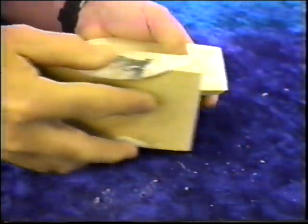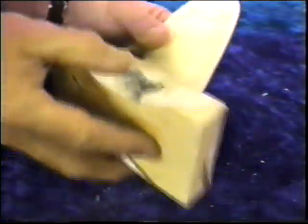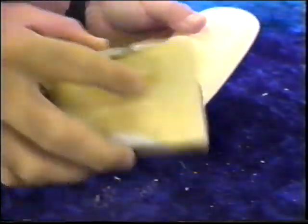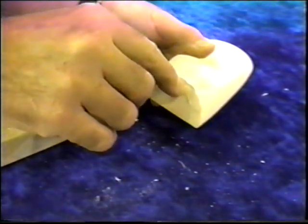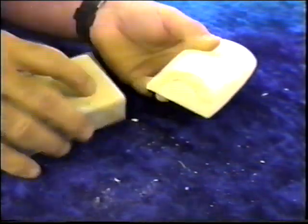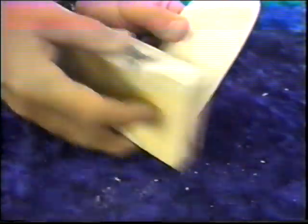This way you get at least a half a fighting chance of keeping those little edges. Edges of flaps, edges of elevators, edges of cowls. And this one is especially important. I don't want to have a rough edge on here. But again, it'll transpose up into all of the molded parts. This edge right here I'd like to keep nice and neat. And I have a chunk missing from when I pulled this off the nose ring, but I can fill that in with some kind of filler before we actually do the casting.